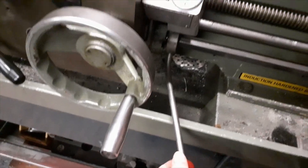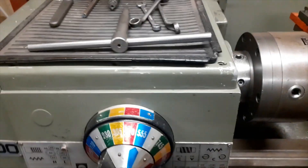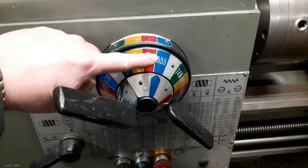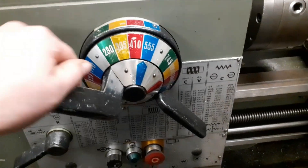You traverse your saddle, and you've got your levers — one is for your lead screw when cutting thread and the other is for your power feed. To the right of it is your main lever: up is reverse, middle is neutral, and down is forward for your motor. Going back up to the headstock, these are the few tools we'll keep handy.